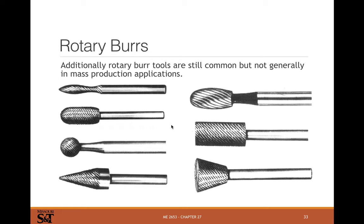Rotary burrs are similar — back in the days when making dies by hand, die grinding was more of a thing, which is literally why it's called die grinding. Now you use little burrs to touch parts up, but you don't see them in mass production because it's a slow hand operation. In mass production you'd CNC machine the part and wouldn't need to come back with a burr. For one-off parts, tool making, home shop operations, or things like porting cylinder heads, burrs are useful. But if you're making a thousand of something, you're not going to sit there and die grind a bunch of parts.